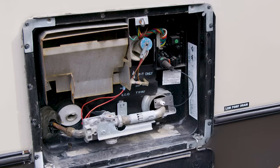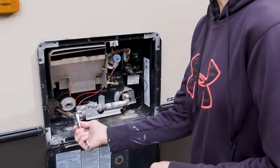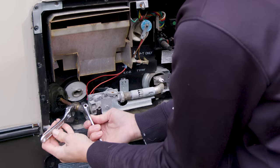For the next step, we're going to disconnect our propane source. You'll need two adjustable wrenches — one goes right here and your other goes on this nut. Then you pretty much just turn it and it breaks loose just like that.